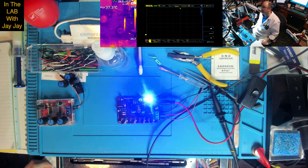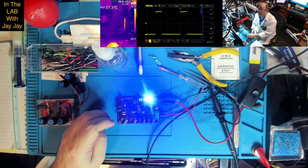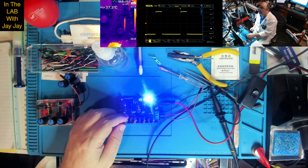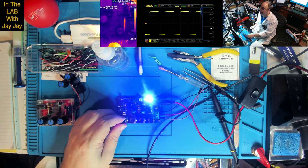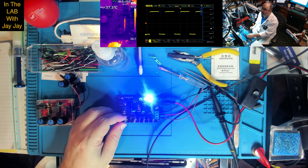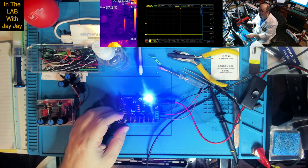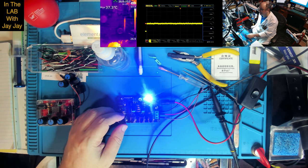Now, if we put him on auto, okay, so that looks like a square wave to me, and that's what we'd expect. Now, if this is duty cycle, I should make the square wave go longer. Yep, that's the duty cycle, and it can go up to 95%. There we go, that's full at 95%, and it can come all the way down to 2%. Oh, well, it can't even detect it at that range. Let's auto-calibrate on the low. No, it's just noise. Wow.